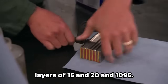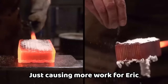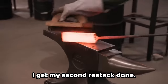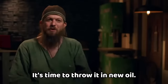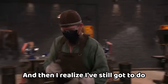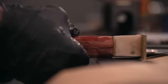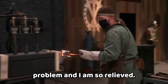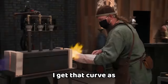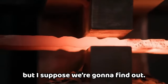I'm starting with 14 layers of 15N20 and 1095. Welding — just causing more work for Eric because he's going to have to stretch out that steel further and stack it more. I get my second restack done — it's time to throw it in the oil. I'm ecstatic, and then I realize I've still got to do all of my handle work. It goes through no problem and I am so relieved. Now for Eric, it's time to put an edge on the blade. I get that curve as sharp as I can get it. Hopefully it's sharp enough to cut something, but I suppose we're going to find out.